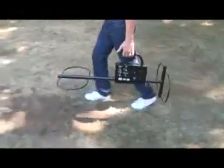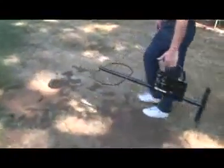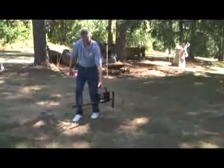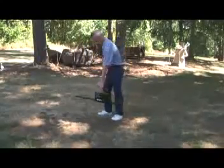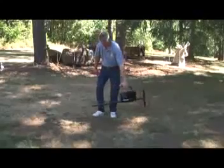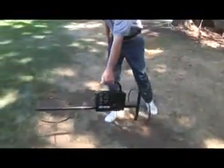When using the no auto position, a surface target can appear to be very large. This is normal. The target must be narrowed down to determine its location more accurately. Pass over the target area from at least 2 different directions. When the meter goes full scale, momentarily press and release the push button control. Continue to cross the target, pressing and releasing the push button control several times.